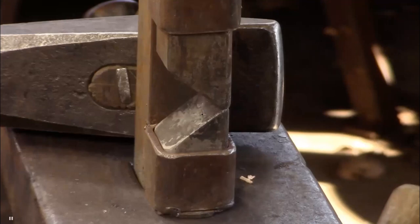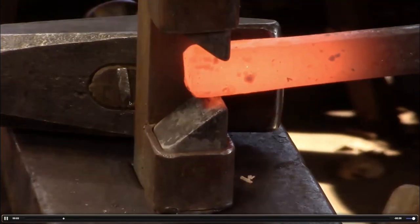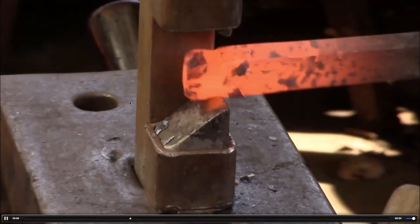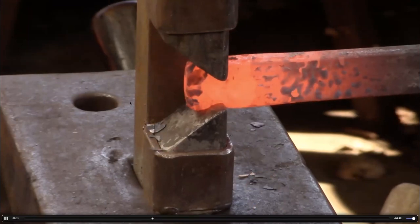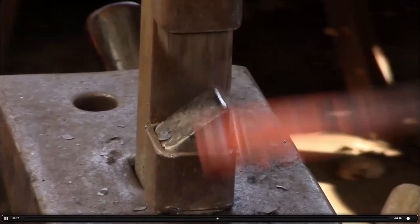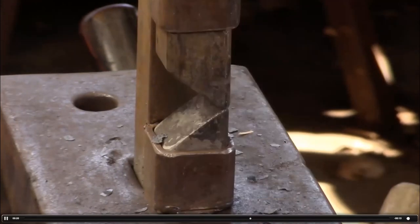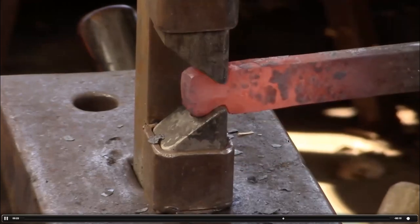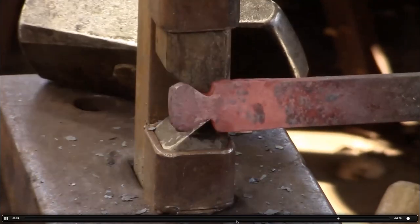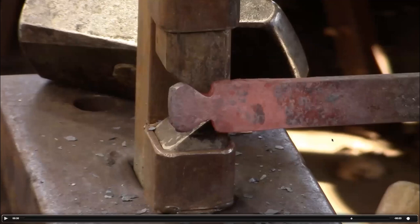Let's watch a video of the butchering. Hold it parallel, come back half the height of the bar. Hit it twice on one side, then flip and turn it over — this will keep your forging even. Dress back to parent stock thickness and continue working until you've reached your depth. You can see we're stopping short of that three-eighths inch square. The next tool will bring us to that three-eighths inch, so we don't need to get all the way to that depth at this point.